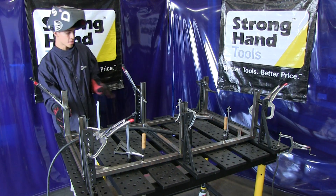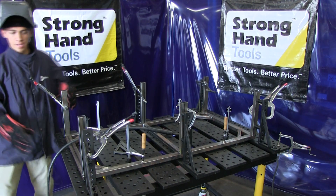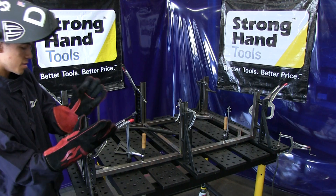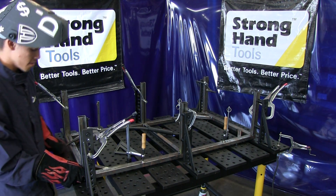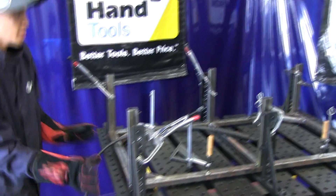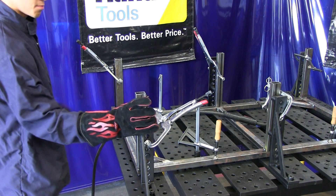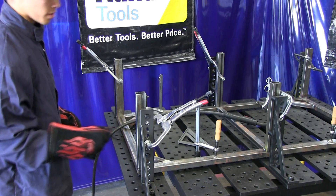So if you noticed, the fixture is just a little bit different now. I use the right angle brackets with the round stops and clamp it together, so that way it's not up against it and I can still weld a little bit on the inside. I also use the magnetic round buttons to elevate it so I make sure everything's level. Since we got it fixtured up a little bit different, I think it'll be a little bit easier, so we'll go ahead and weld it.